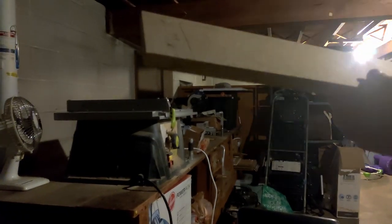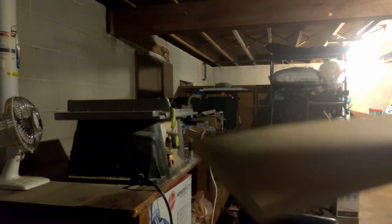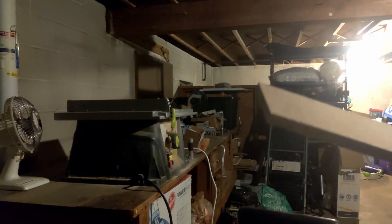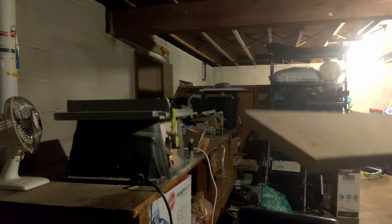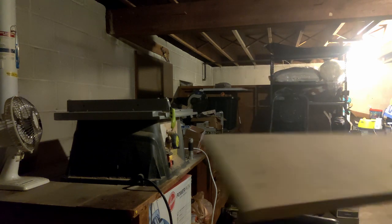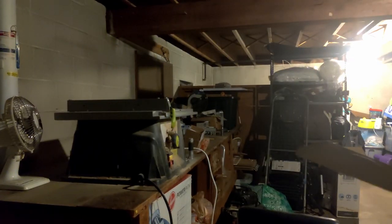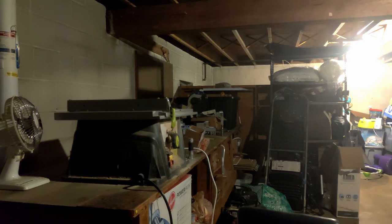As you can see, we've got a pretty clean edge right along where we want it. Now, the tricky part is going to be this cut up to here. I'm thinking that what I want to do is drill these holes last. And what I want to attempt to do with this cut is maybe use my chop saw and then get the corners with my jigsaw, or I might just use the jigsaw to kind of ride the pencil line. So let me swap out tools, and we'll come back and see what we do.